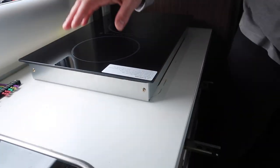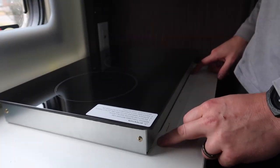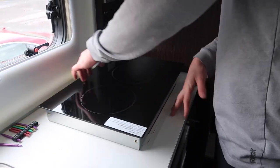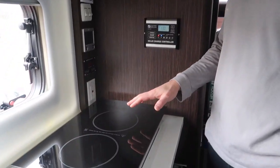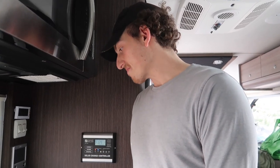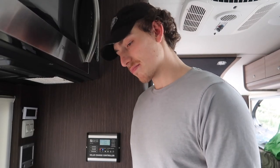This is the cooktop we got off Facebook Marketplace. We'll put the Amazon link below — it's about $239 on Amazon; we paid $100 off Facebook Marketplace. It's an Impava 12-inch by about 20 inches. The original hole was about 17 inches, so I actually have to make the hole bigger. We're orienting it left to right because of our space — it wouldn't fit up and down either. It has an outlet, so we're going to wire an outlet under the sink so it can plug in. The wiring won't be in this video. It looks pretty sweet and matches our sink, and it's a lot safer for us.